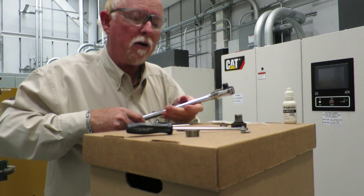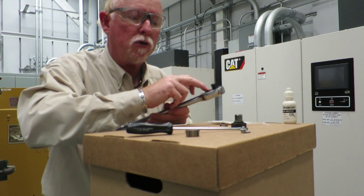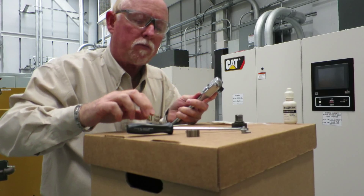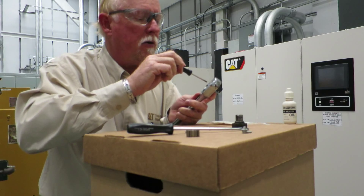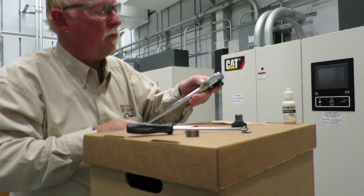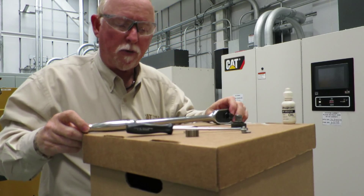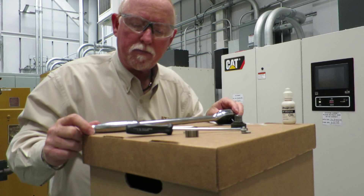Grease a little there, grease a little there. Take the cover, put it back over — make sure you put your o-ring on there — then flip it over and put your screws back in. You can use a Torx 15, a slotted, or a standard — it doesn't matter. Torque them down pretty good. And there you go — back and forth, on and off, things sound good. You've basically saved yourself a lot of trouble: instead of throwing out a perfectly good ratchet, you've taken a very inexpensive kit and repaired it yourself.